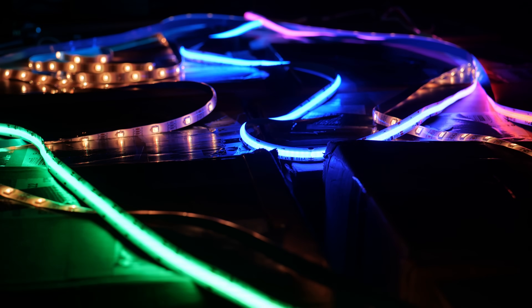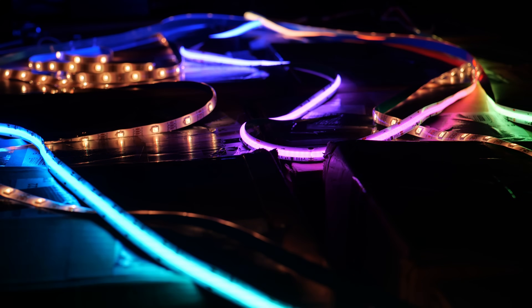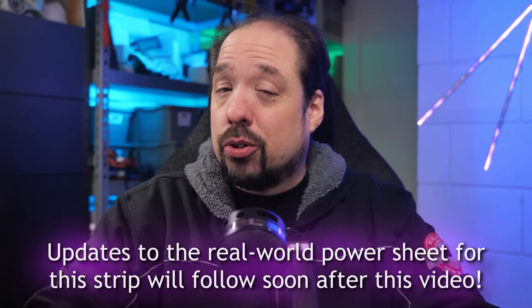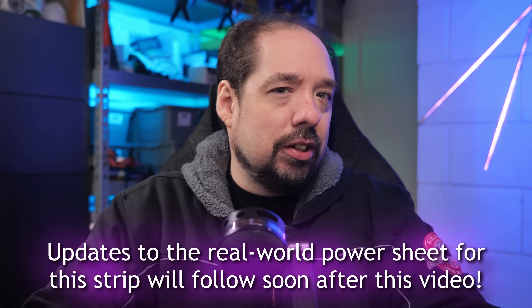And let me tell you, it looks absolutely awesome. At full brightness, any individual LED or even segment on a blended pattern completely falls away, and it just looks like pure neon. Last thing I want to highlight is the 24V part. Because of this, voltage drop is much less of an issue. If you just want to run effects and single colors, hooking up 10 meters with a single injection works great. If you want to go beyond that, say 15 or 20 meters, you'll need at least front plus end injection for generic usage. But generally if you're wrapping around your room — front and end, 20 meters — that shouldn't be a big issue. And even if you have to run an injection wire, since it's 24V, that wire can be a lot thinner than it would have to be for 5 or 12V LEDs.